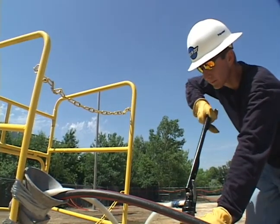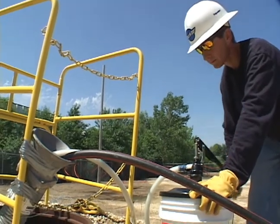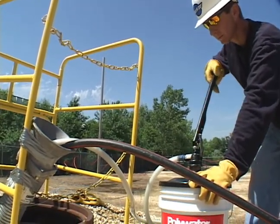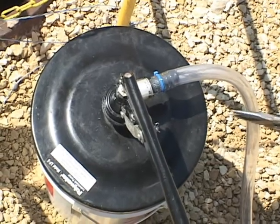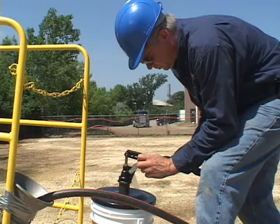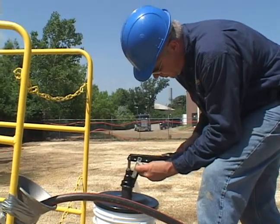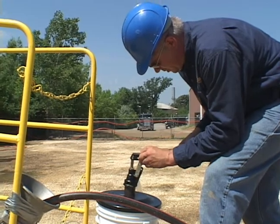Polywater makes several pumps. The LP3 is a hand-operated self-priming piston-style transfer pump. Both liquid and gel Polywater lubricants are pumped through the LP3 by adjusting the mechanical advantage ratio setting. The pump instructions include ratio setting recommendations, and this adjustment is quick and simple as is shown here.